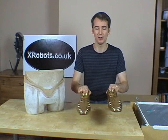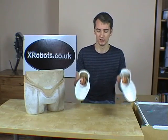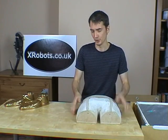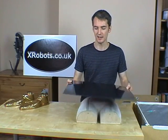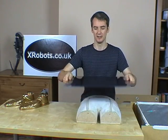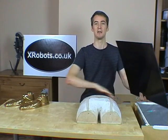If you want to have a look at my website you can see the rest of the C-3PO projects. I've also used this process for making some pieces for R2-D2. The mould for these looks exactly the same but it's made out of wood. I've got another piece of C-3PO here which is C-3PO's bottom. I've also got a sheet of plastic — this is a 2mm thick HIPS which is high impact polystyrene sheet. Basically we heat this up so it's all soft, then stick it over the mould and suck air through the bottom, which sucks it down and it forms over the shape to make a rigid shell.